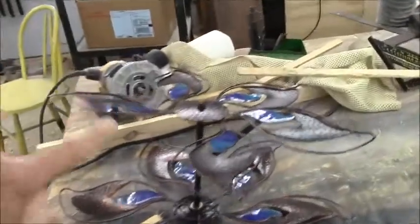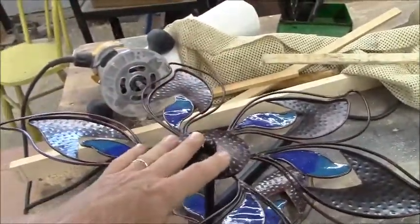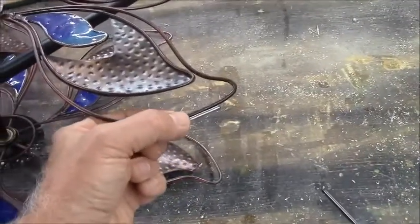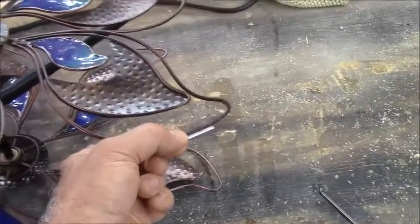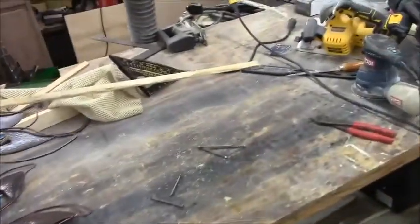What I'm going to have to do is disassemble it. I'm going to take this nut off, get this guard off, take this part so I can lay it flat. But I'm going to practice first on some nails, which are almost exactly the same size — actually they are the same size as the wire. So I'm going to practice with my welder settings before I actually get into working on this. Let's try the welder setup first.